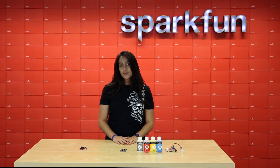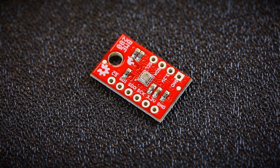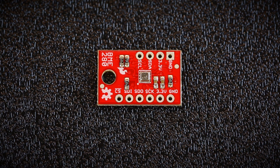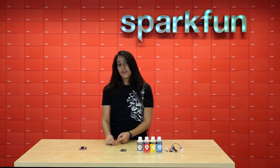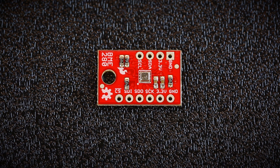Next up, we've got two new products this week. The first of which is the BME280, which is an atmospheric sensor that does humidity, pressure, and temperature. Some upsides of this is that it's really accurate — it has to be really accurate temperature-wise, because it's taking those temperature readings and calibrating the humidity and pressure from it. It's really small, so it's easy to fit into projects. Again, it's highly accurate, and it has fast response times and takes very low power.